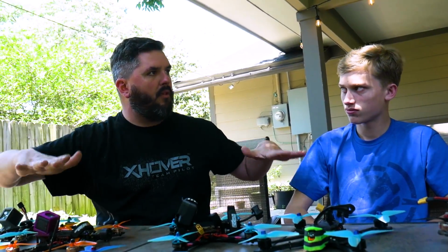I want to talk about my evolution in the hobby. When I first got into the hobby, I was flying a QAV 250. It was 250 millimeters motor to motor, and we kept shrinking things because we got smaller and smaller electronics, more and more things on the same PCB, and I went to the H frames, and then I got on the X frames, and I loved how a symmetric X flew. But when I went to an X, we shrunk them down. We got them down to 180 millimeters for a 5-inch quad, and I loved the behavior, but it was so twitchy because there wasn't that stable platform.